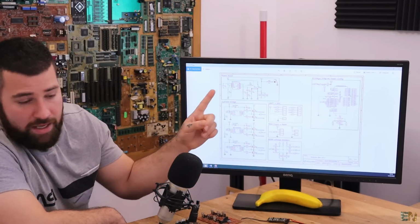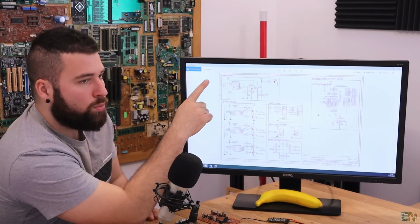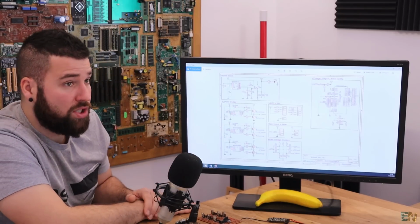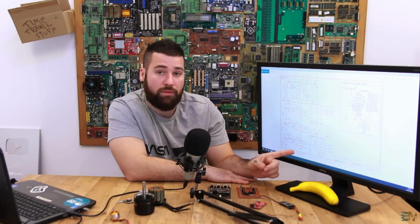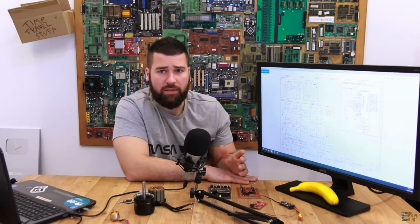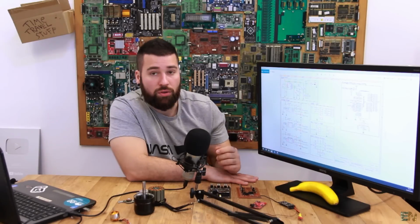Okay, the next step is the power regulation here. As you can see, I'm using a buck converter and I'm only getting from 12 volts or 20 volts to 5 volts. But when you increase the voltage to 48 volts, what you will see is that the MOSFETs will be connected to 48 volts that will go to the motor, but the maximum voltage for the drivers is 24 volts. And also the maximum voltage for the microcontroller is 5 volts.